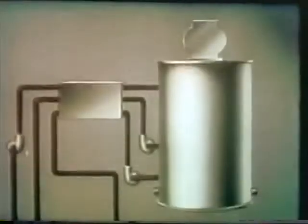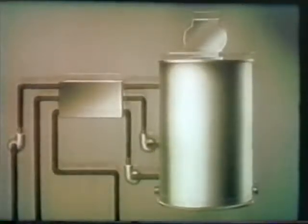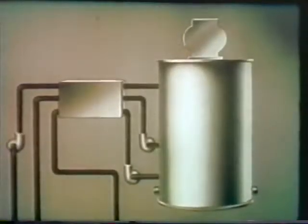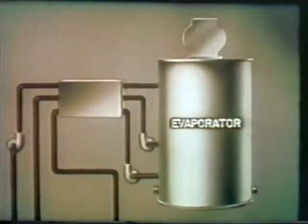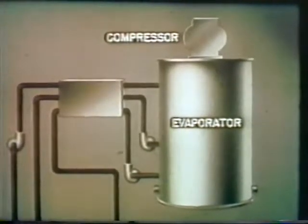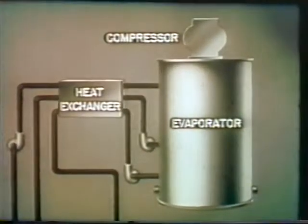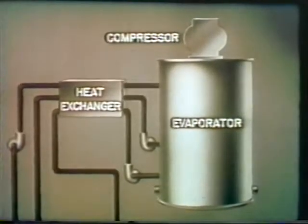This diagram represents, in a general way, the several types of vapor compression distilling units used by small surface ships and by submarines to distill fresh water from seawater. There are 3 main components: an evaporator where seawater is boiled and the vapor condensed to make distilled water, a compressor, electrically driven, which generates heat by compressing the water vapor, and a heat exchanger which uses hot liquid discharges to preheat incoming seawater.